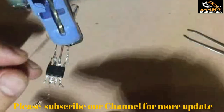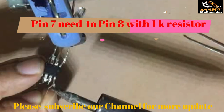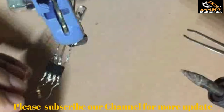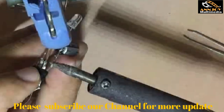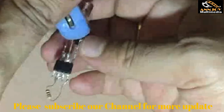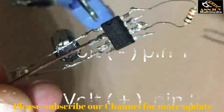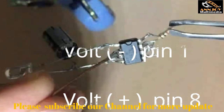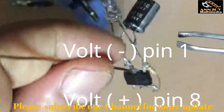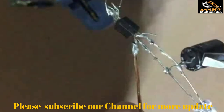Pin 6 and 7 are now connected via the resistor. The other side of the resistor connects to pin 8, which is the positive side of our project — 3.7V battery positive goes here. The negative is our project ground. So to summarize: pin 8 is positive for 3.7V, pins 6 and 7 are connected with the resistor, pin 1 has the capacitor minus and LED minus, pin 3 has the capacitor plus and LED plus.